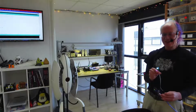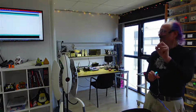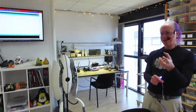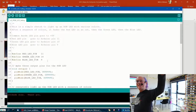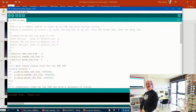And that's exactly what we need to do for the LED strip. Each of the red, green, blue RGB LEDs on our LED strip has a microcontroller. And one LED with its microcontroller here is connected to the next RGB LED with a microcontroller, which is connected to the next one, the next one, the next one. And there's some code already written by Adafruit, an open hardware company, that makes it really easy to play with RGB LEDs, so you don't have to figure out all of this low-level stuff.